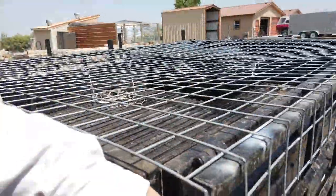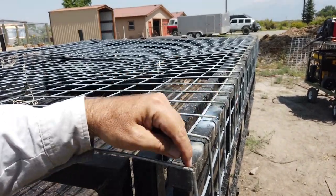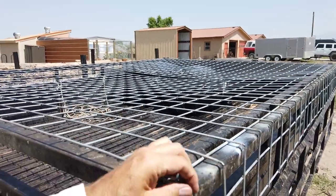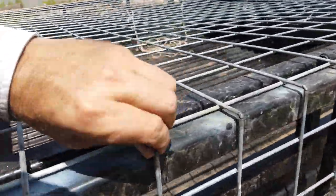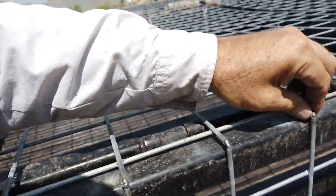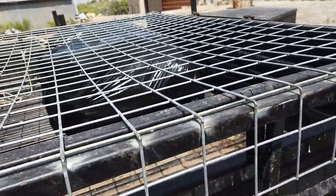What I did was, this was sticking out like this, and I just notched these, cut them about halfway with a little cutoff wheel, and then folded it down. Of course, they cracked, and that's why I welded them. This is on like 15 volts, way down there, and like 12 wire speed, not 12, I'm just joking, but way down there. So those will fit nice and snugly.